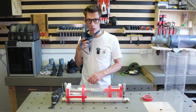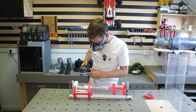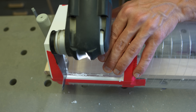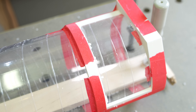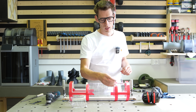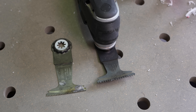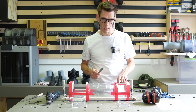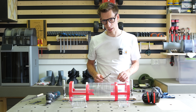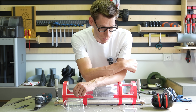I cut parallel to the jig with the oscillating multi-tool. The fumes of acrylic are toxic, so protect yourself and open a window if you can. Acrylic really likes to melt, and I took a blade with bigger teeth for the last part, and that went very well. Now it's time to clean the edges with a file or sanding paper, and you need to take your time for that, because acrylic is brittle and will not flex like PVC.